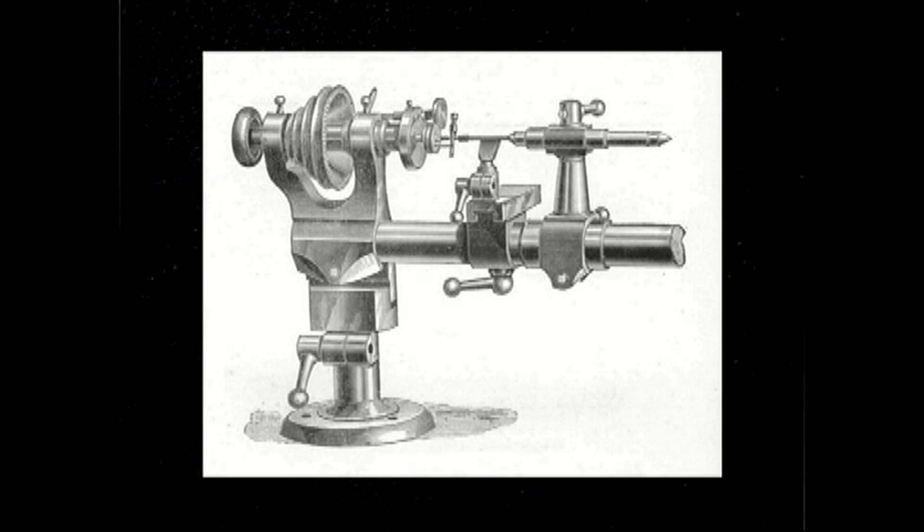The lathe bed of the Geneva, or Swiss lathe, is more round like a bar versus the American lathe which has the shape of the letter D. In the picture, the Geneva lathe looks like a very large lathe, but actually it's not. They are a smaller stature than the American lathe. The diameter of the American lathe bed is about 2 inches, while the approximate diameter of a Geneva bed is 3 quarters of an inch. The size of the lathe bed thickness is what gives the advantage to the American lathe — you won't get any flexing on the lathe bed on an American lathe.